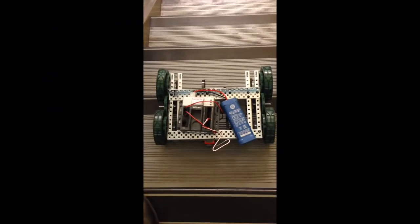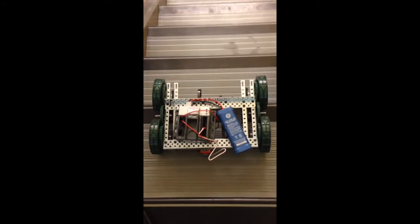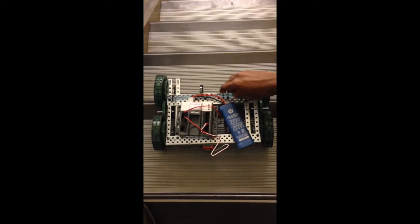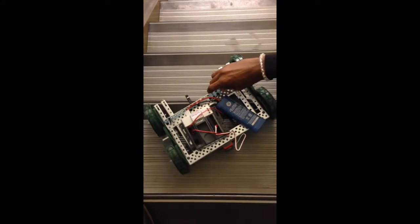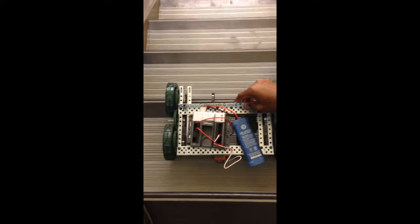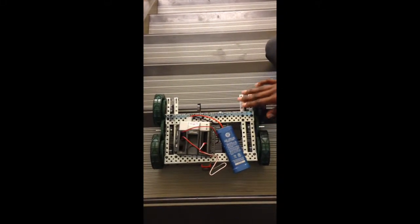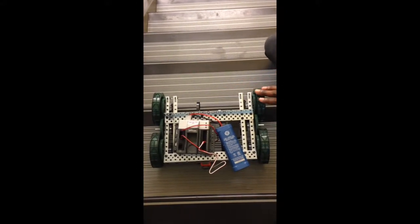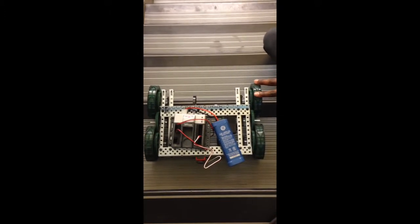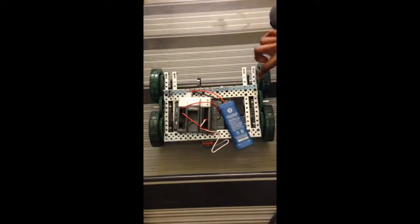The turning scrub is the friction which resists the robot's turning. This is caused by wheels dragging sideways on the ground as the robot turns, resisting the motion of the turn. Turning scrub is also expressed as a torque about the turning point of the robot, opposing the turning torque. The turning scrub is a negative force towards the robot's direction of movement. Turning scrub is maximized in normal wheels.